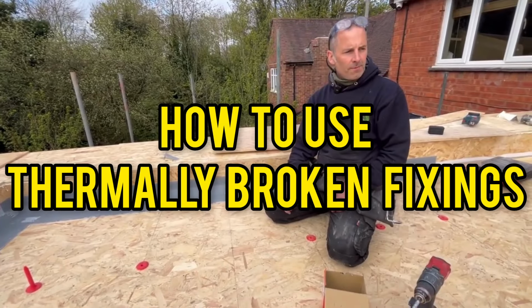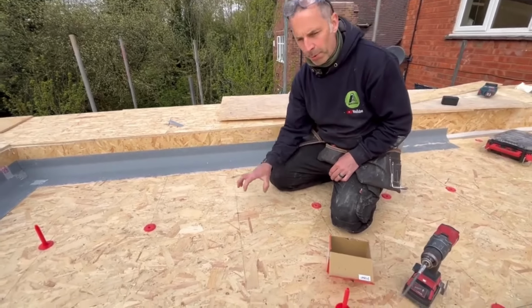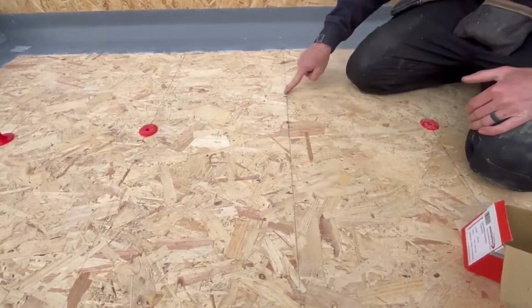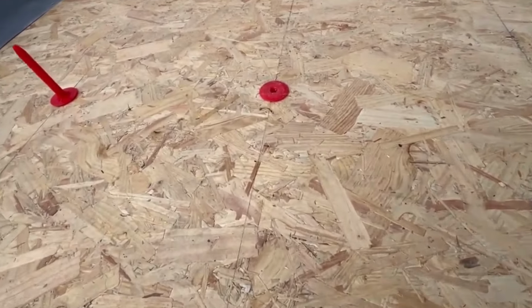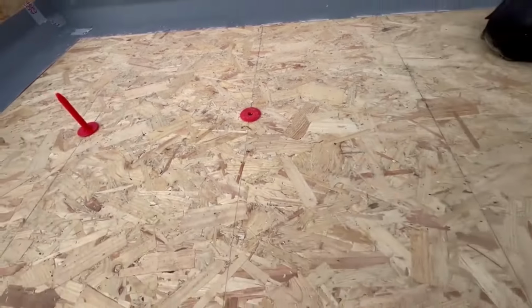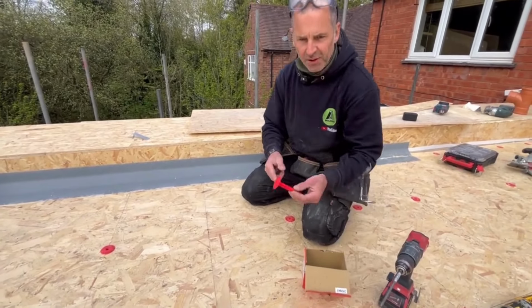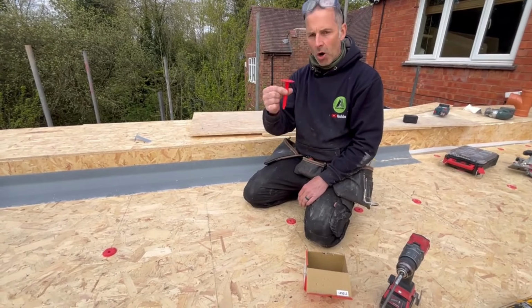Right then, we're coming to our finishing stages with fixing the top piece of ply down. You'll see on here, if you can see it on the camera, the lines, and what these lines represent are the joists or the flat roof rafters, whichever you want to call them, underneath the insulation, because in order for these to work right, and Adam will go into it later on, I think these need to go